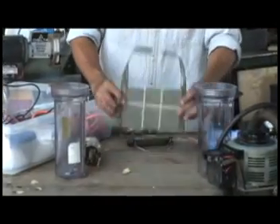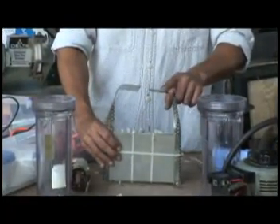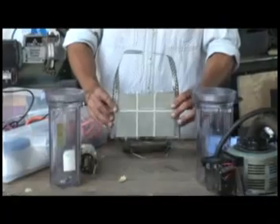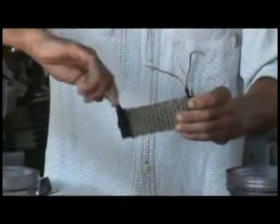With this big plate, it was just too big — too much surface area, drew too much current. Also, these little brackets I made to hold it are also out of stainless. Remember, stainless is a resistor — it resists current and heats up, so be careful. You want to use wire. But the problem is wire will corrode in the solution because of the electrolysis process. So, as you can see here, I plastic coated the ends — wired them all together, soldered the copper wires together, plastic dipped them, wires are protected, ready to go in the tank.